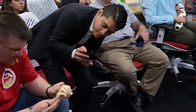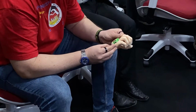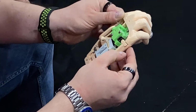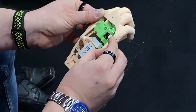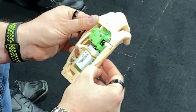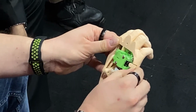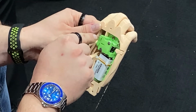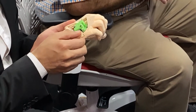The motor that we've been using is rated at 3 volts. So they're very tolerant to both voltages. You get your torque. Specified from 2 to 30 RPM for a 3-volt motor. Run it on 9 volts, and we get the performance. And with these two devices, as long as this circle is closed, this circle down there is a closed circle, and now it will open again. Oh, yeah, that's pretty smart.